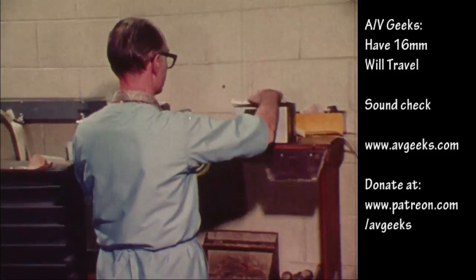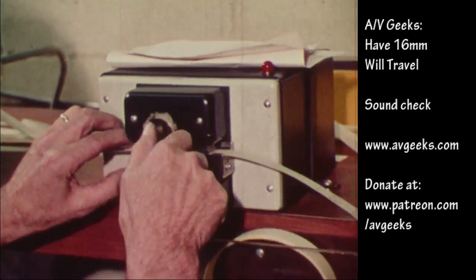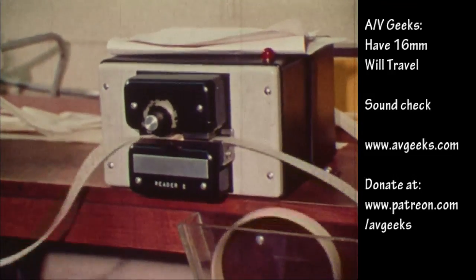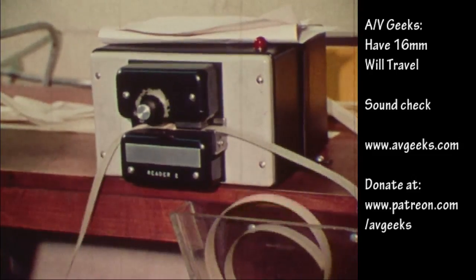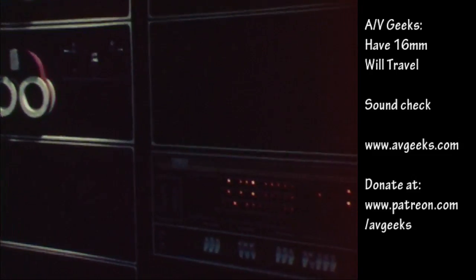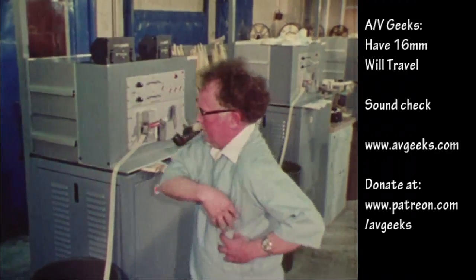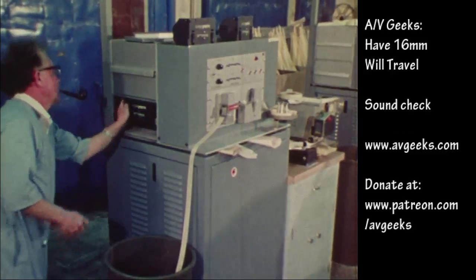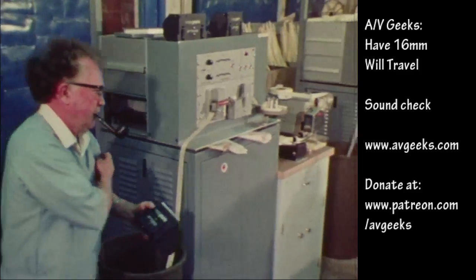News stories, when they come to the new offset composing room, have already been punched on paper tape by a TTS operator. The tape has been coded for type size and style, location in the newspaper, and column width has been justified by digital computer. Inside the automatic compositor, a lightning-fast photographic type drum spins and exposes each letter in proper sequence at the fast rate of 28 lines of copy per minute.